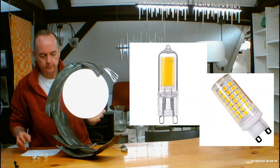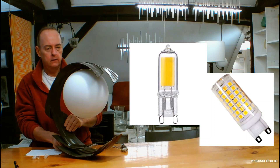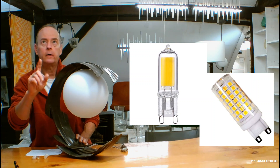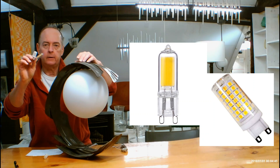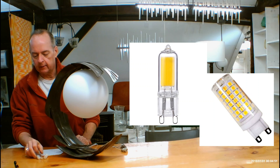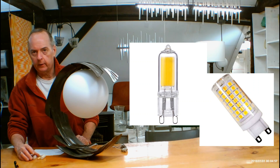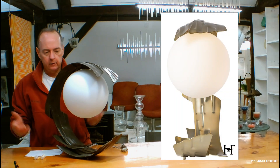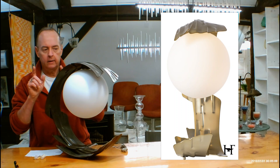This is a little on the cooler side. What we like to use in our showroom is the warmth coming down on my hands right now — these are 3000 Kelvin LEDs above me, soft white or warm white LEDs. These are going to be offered to you in all kinds of different ways, like 2700 Kelvin, which is a super yellow light. They're also going to be offered in something called daylight — be really careful, because daylight sounds like it should be a warm light. It is not. Daylight is going to be like a cold hospital waiting room or convenience store light, and that's going to be 4000–5000 Kelvin. You really can play around with this by using different types of G9 bulbs in the colors that they present to you.